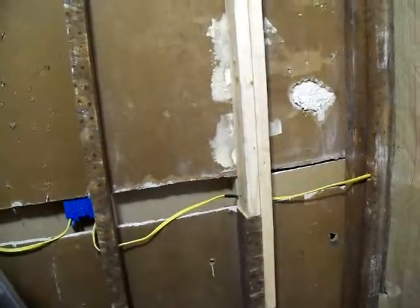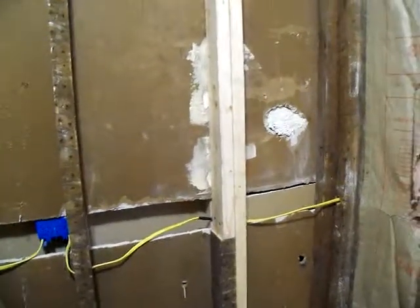I'm going to just chop that off. I took out the medicine cabinet and spliced in some new pieces here. I nicked the wire there, so I'm actually going to have to put a junction box in the wall because I can't just wrap it in tape like that.